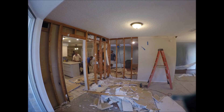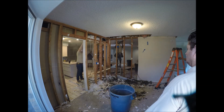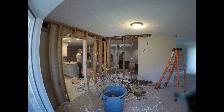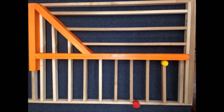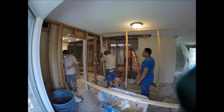We are continuing to strip off sheetrock and then we'll start opening up the ceiling to get ready for the beams to go up into the attic. All the beams in this configuration are installed in the attic to give you a smooth flush ceiling when we're done. The attic beams are coming up in this diagram — the camera is where the red dot is, Elio is where the yellow dot is. The big beam tees into the perpendicular beam, and then the 45-degree beam represents another wall that's back through there.